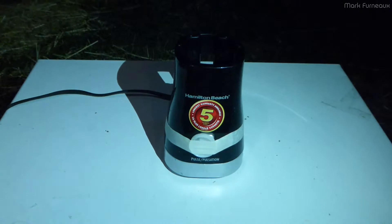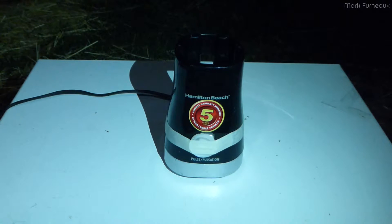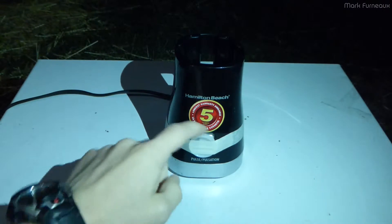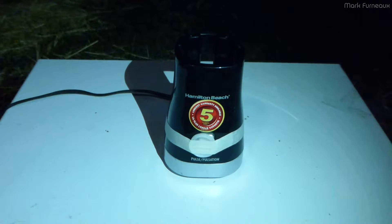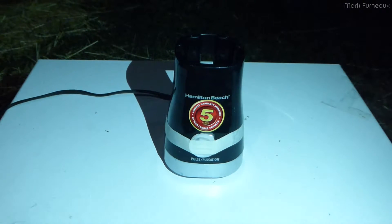I've got my 12 amp Variac beside me and we're gonna crank this to 250 volts and see what the motor does. I've just got a bottle cap I've taped to the button so that it's permanently on. Of course, as always, don't try this at home unless you know what you're doing. Unfortunately it's nighttime so I've got to hold a light.